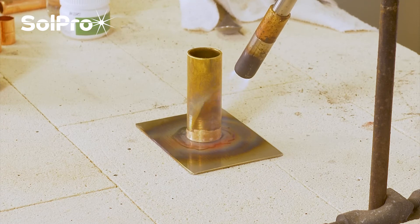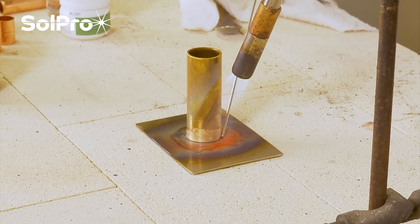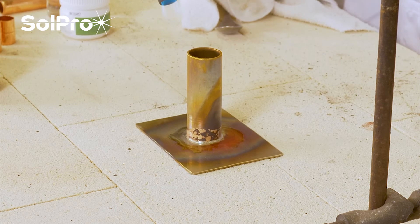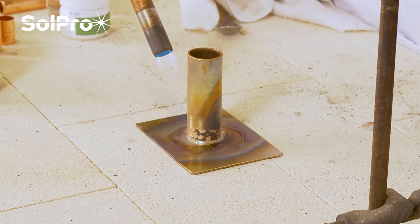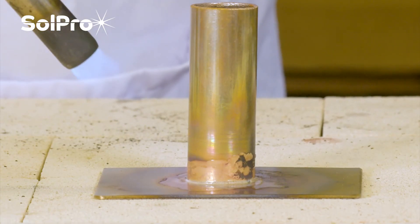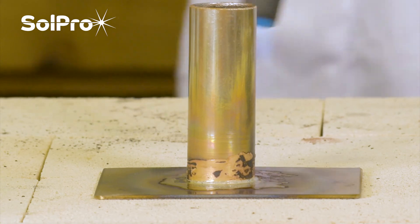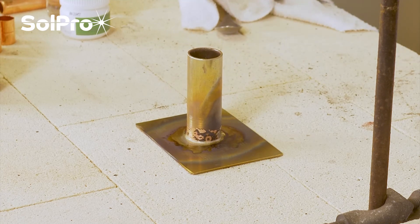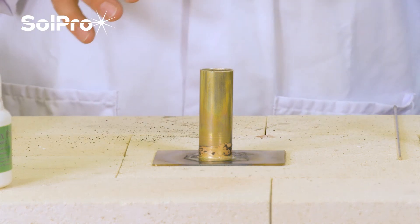The steel's just starting to get warm enough now so I'm going to try applying the heat and applying the brazing alloy. You'll see when it goes there it's starting to flow round, and then coming back round this side — with a better heat source you'd get this in one — but you can actually see where I'm applying the heat the silver solder is going all the way round. We've actually achieved a stainless steel to brass braze just using a domestic plumber's gas torch. The joint is now completed and we'll quench it and give it a clean up.